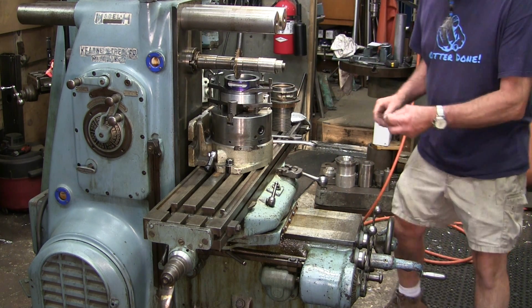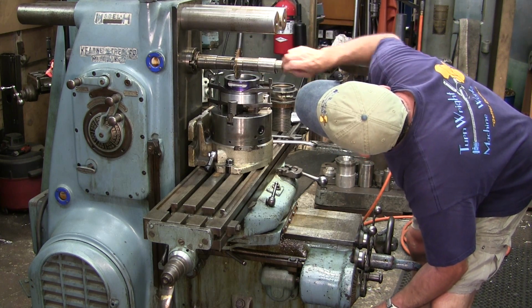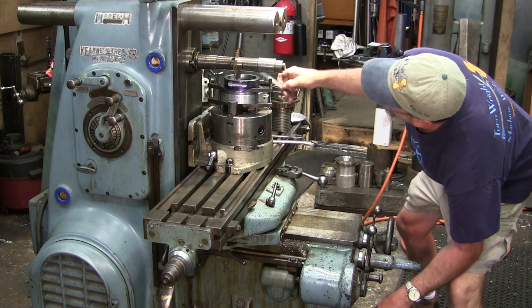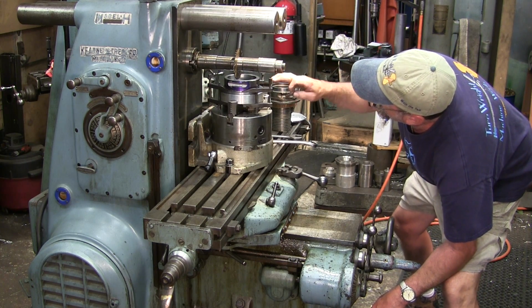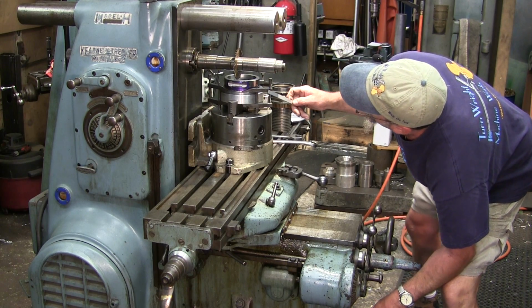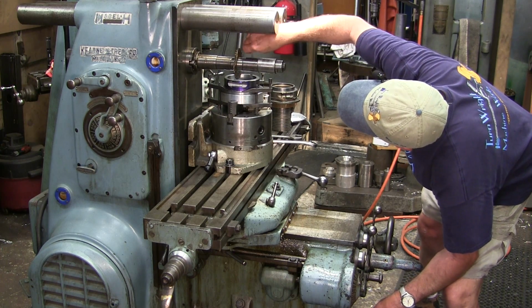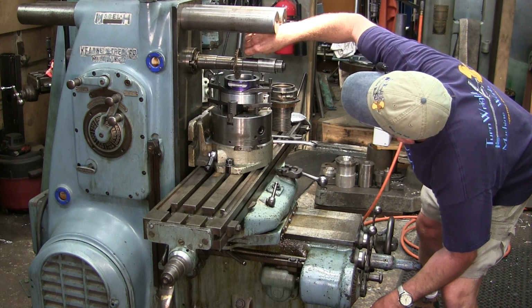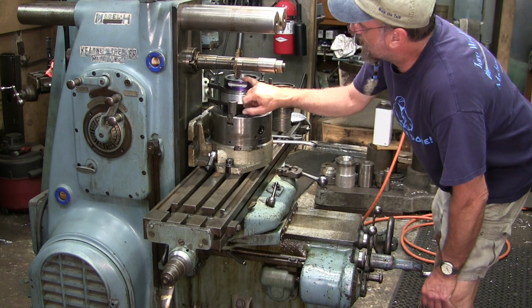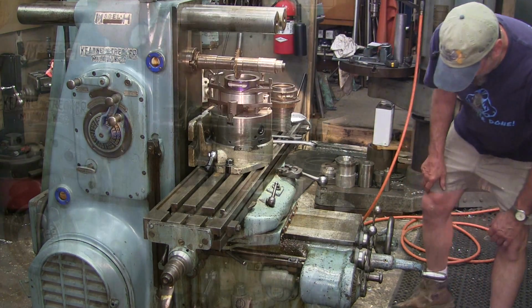Okay, I'm going to bring over a couple scales that I like to use here. Now, we're going to be coming almost 1 inch deep, so I need to make sure that I can travel downward 1 inch from everything that's going to be setting here underneath this bar. And right now I'm about 1/8 of an inch there, so I need to know that I have about 1/200 over that. So I should be able to clear this bar to this part here. Everything else is going to be a questionable deal.